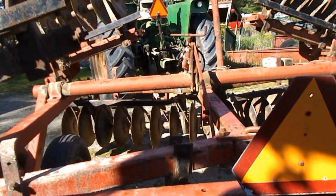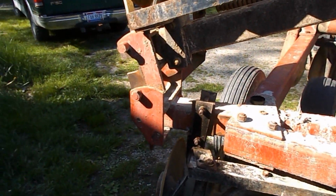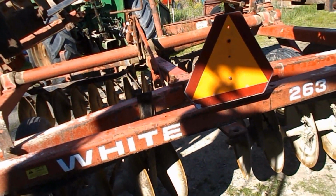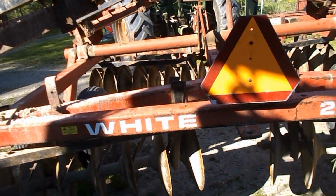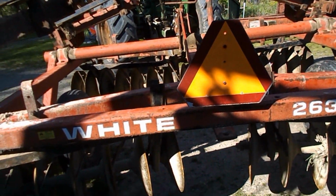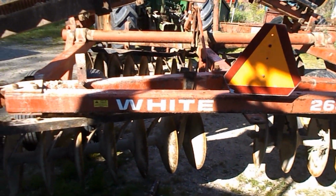For the most part, I've moved this gang from right there to right there, which now the gap between the blades is more like a spool spacing instead of being about a foot. I don't know why they moved it over, but it's been moved back, and we'll see what it does, because I do already know it was giving me an issue in the center of wanting to plug because it was so close. So maybe that is enough now that'll solve that problem.